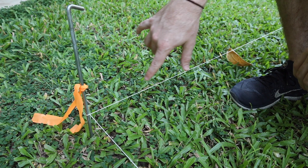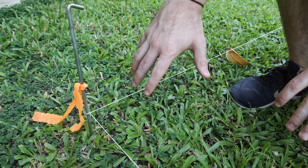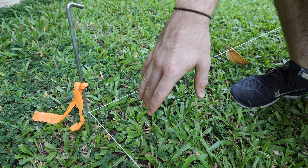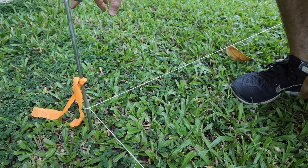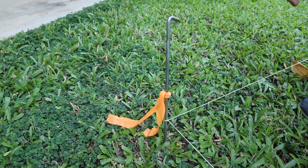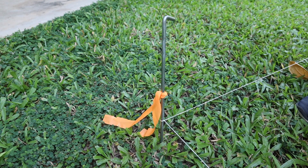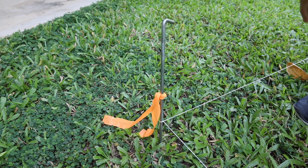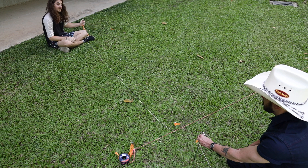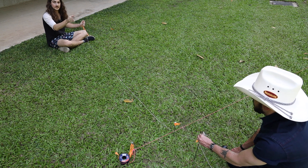You can see the edge of our square, but once we start to excavate, the corner pegs will eventually fall in. So we set up offset pegs further back on either side to recreate the same corner without relying on the central peg. These offset pegs can stay in place throughout the excavation for weeks. We line the string directly over the top of the peg so that where the two strings cross will be our corner.